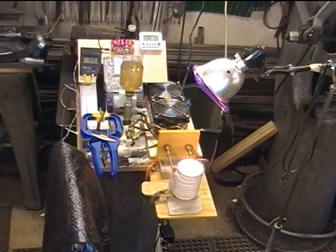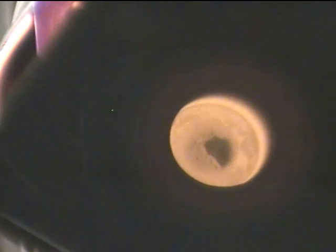Now we will switch to the number 8 filter. The number 8 electric welding filter is in place. I'll put some more copper in here. I shouldn't drop it like that — it does spit a little bit. We're down to 35 amps. That melted pretty quick, didn't it?